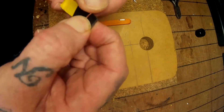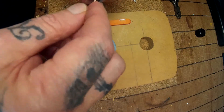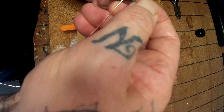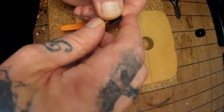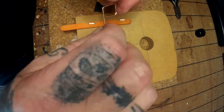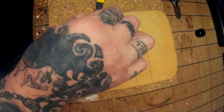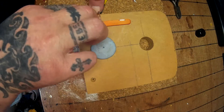We're going to bend a piece of wire — that's your waste that'll be getting cut off at the end. One bend, and again. Now to achieve the other bend, I've allowed for the thickness of the wire gauge, so when I bend it at 90 degrees I'm going to have to shift it over this way, like that.